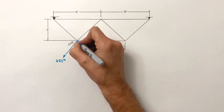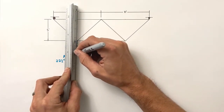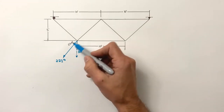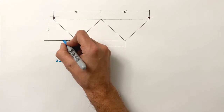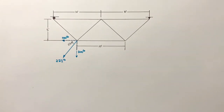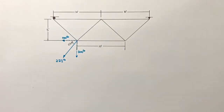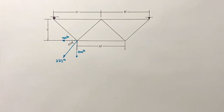This angled load has a vertical component of 200 pounds downward (223 × sin 63.4°) and a horizontal component of 100 pounds (223 × cos 63.4°). So we're actually dealing with two loads starting at the same joint. We handle this just like any multiple-load problem — working out the sum of all torques around the roller and the pin — and from there the truss is solved just like any other.